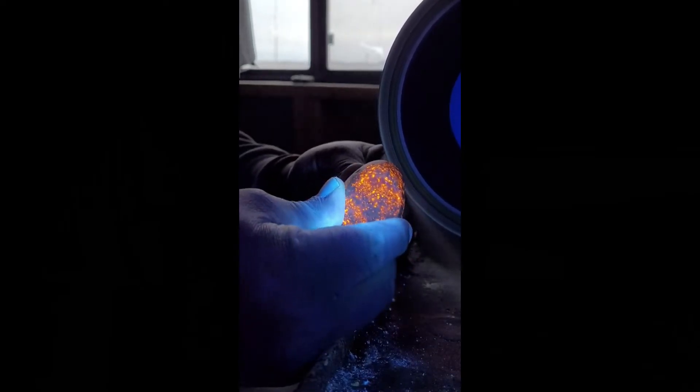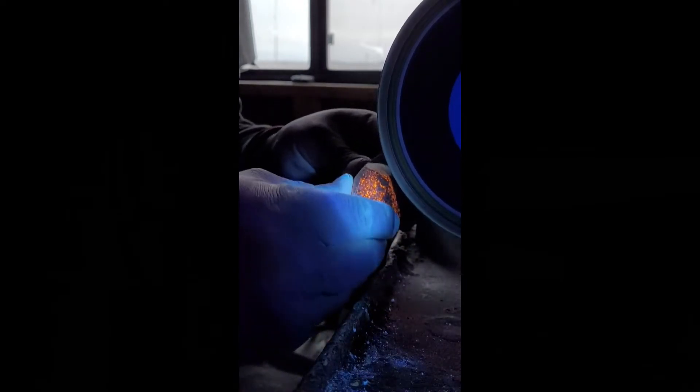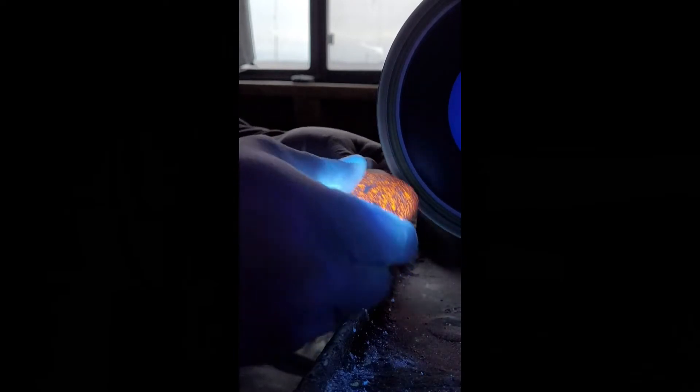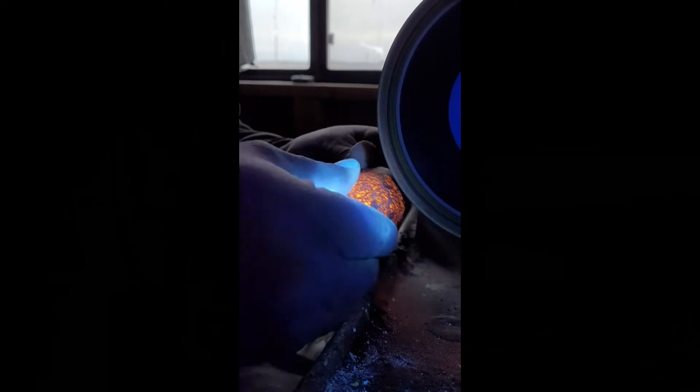He's using a 45 grit sintered hard diamond wheel. If you notice, he's not using any water — he's using a dust collection system and wearing a respirator. You never want to breathe in rock dust; it's very, very bad for you. Brian does most of his carving right here on the main wheel and he really roughs it in really fast. I sped this up so it's a little faster than normal speed.